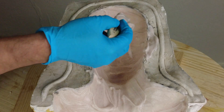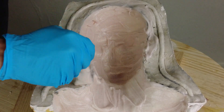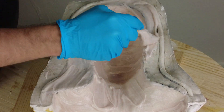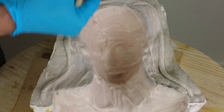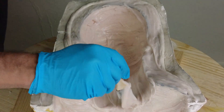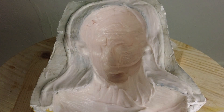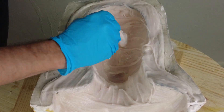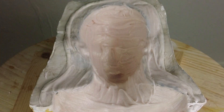You could technically do this all in one layer, but it's much better practice to do it in a couple of layers. I'm brushing it up on the flange for two reasons: one is to give myself a place to check when it's cured, and also to protect that flange — when I pour the foam in later without fully closing and strapping the mold, I don't want flexible foam getting on that exposed HydraCal seam. One of the things about flexible foam is it doesn't want to stick to silicone, but it wants to stick to everything else in the same zip code.